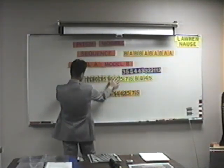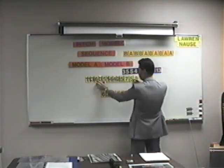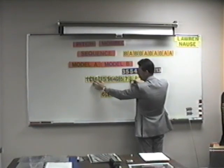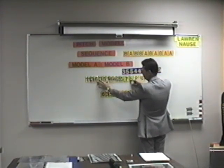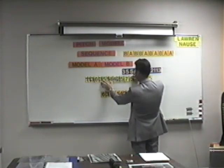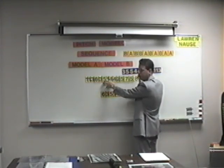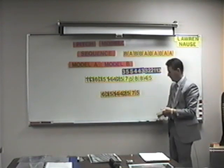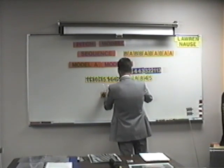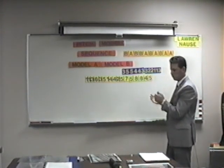So now this is all we're doing. We're just sliding this along like this. These lines come along, and we see if we can find a spot. And right there, see the lines all match up with the pitch sequence. Move it one there, and things don't line up. See where this line is right in the middle of a 4? Move it back there. Oops, the wrong spot. Right there. There it is. Okay. Sometimes when you get close, it comes close to fitting. It's getting to look real good, and then all of a sudden, bang, you're right on. And other times, you're right next to it and it's right out of whack. You move it one, slide it down one element, and it fits. Now you see it as I slide along. That's basically what we're doing. Okay? So it's not all that mysterious a thing. I cut these out just to demonstrate how to put these pitch sequences together.